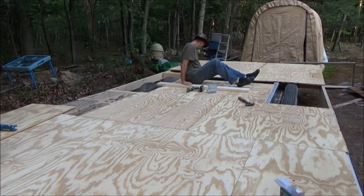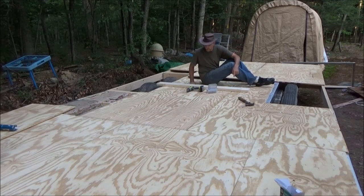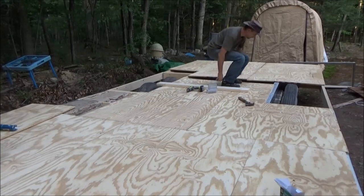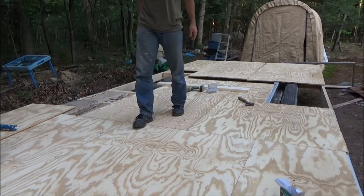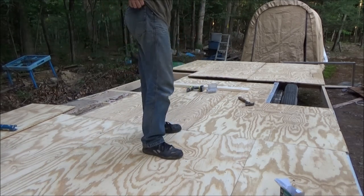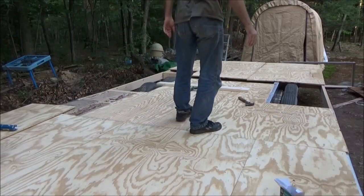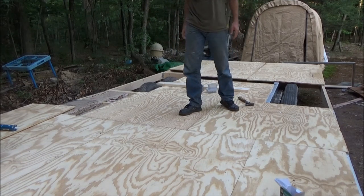Double check my work. Everything's down. I see all the seams are in, all the way across. Looks like it's gonna be okay. Yeah. Feels good. No squeaks, no creaks. I've been walking on this all day, I can't avoid it. While I'm working on it, I'm gonna sand this floor anyway when I'm done. But I try to kick off my feet, and I've been sweeping the floor as I go. There is no give in this floor at all. 3/4 inch tongue and groove is good.